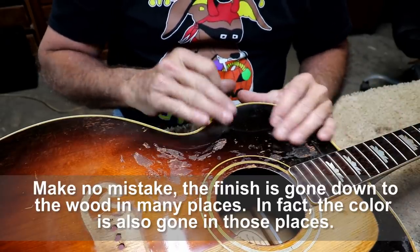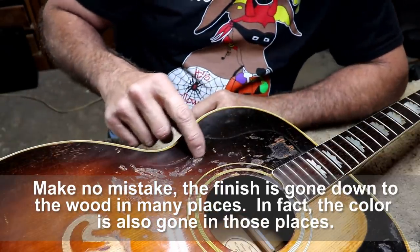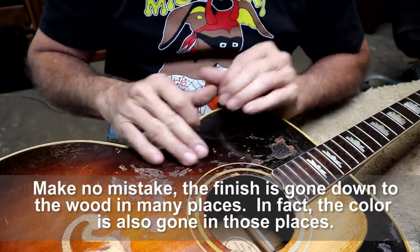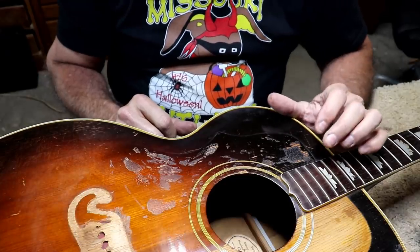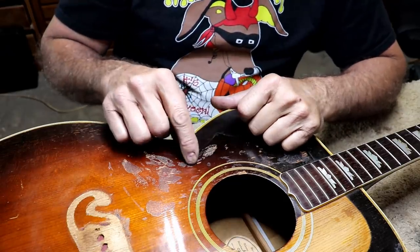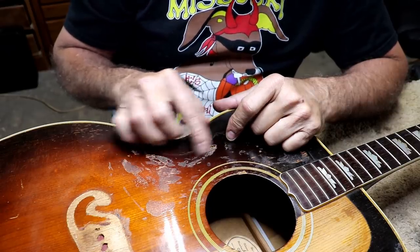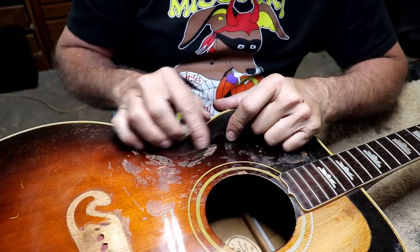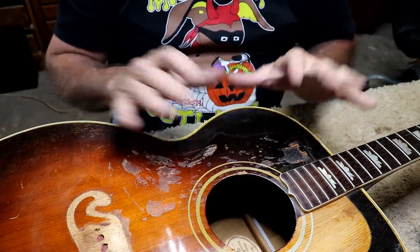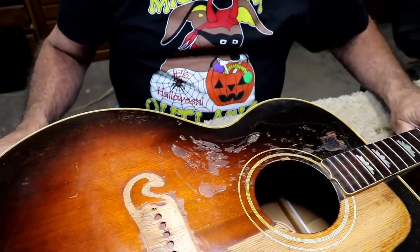This finish is blistered and it's pulled up and pulled off. I'm going to start in a place where it's black, where maybe it would be a little less noticeable. I'm just going to experiment with some ideas. The finish is melted, it's gone, so you can't just buff that out. What I was thinking about doing was taking a little tiny amount of lacquer thinner, trying to melt the finish, paint it around, put a little black dye in there, light them out, maybe a little brushing lacquer, and see if we can't blend it back. You just got to try something - you never know till you try.